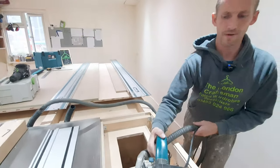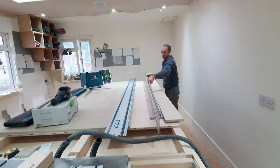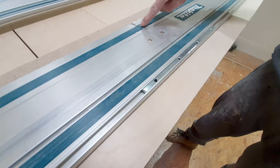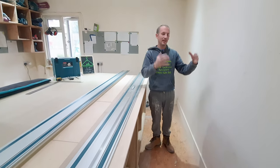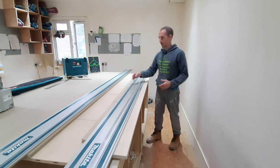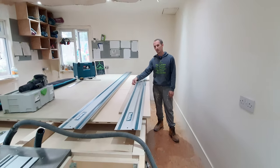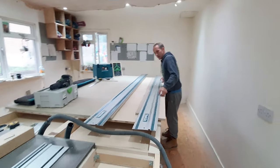There we go - first cut, and that's our reference cut. Now let's grab the jointed version. The way they join is you've got one bar at the back held on with grub screws and one at the front - I'm actually missing a grub screw there, but it's still nice and tight. Remember, your cut is only as good as this joint. If these tracks have been bashed around in their case and they've not been protected, they're going to get damaged. You can take them to an ironmonger and cut them square again with a fine tooth or metal blade, but if your saw is out even a tenth of a millimeter, over three meters that could be out three mil or so.